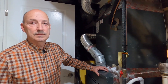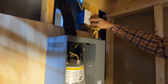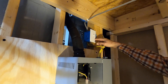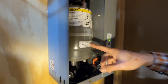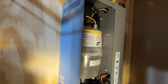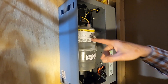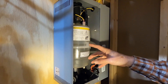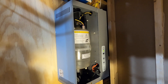Here are the internals of the humidifier. We've run our circuit here — now this looks like a typical light switch but it's actually a double pole switch. This is a 240 volt switch and we can kill the power to the humidifier. Inside the humidifier is this canister — it's really fun to watch. When we first turned it on we were watching it; it has a probe that goes down into the water and two electrical probes. We are literally boiling water inside what looks like a plastic canister.